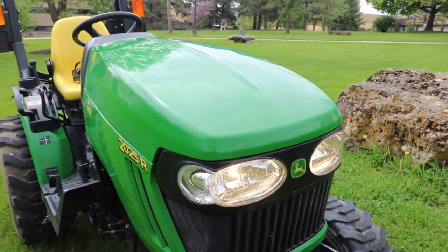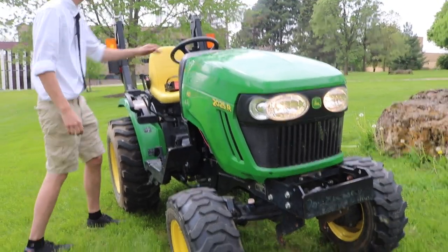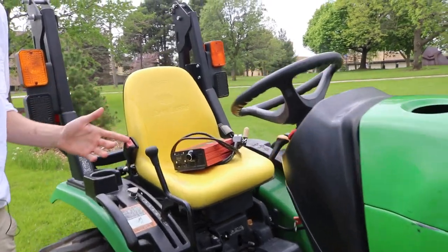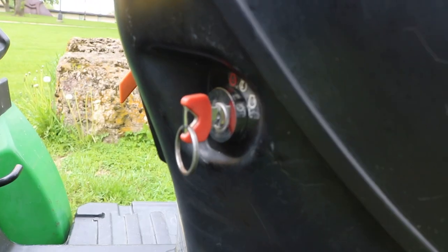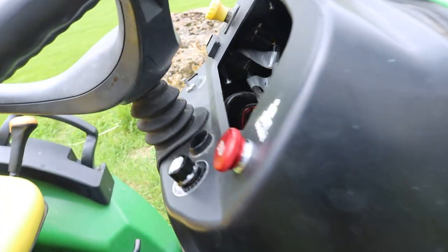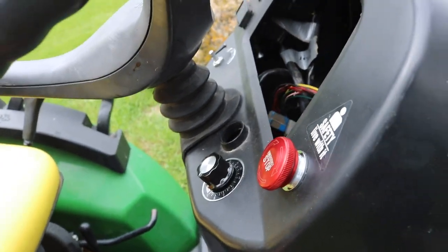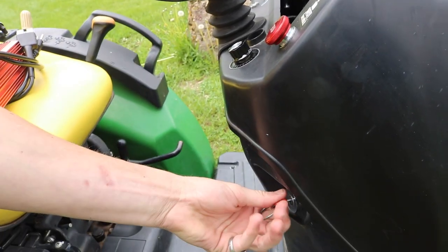All powered by the DC-to-DC converter. So there's no 12-volt battery on the system. We hooked everything up to run off of the stock ignition switch. In the off position, there's no 12 volts going from the DC-to-DC converter to anything and the whole tractor is dead. Key on, 12-volt system powers on, and then normal start, just like you would on the diesel motor, to start up the contactor.